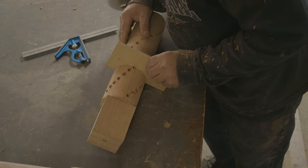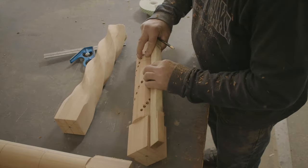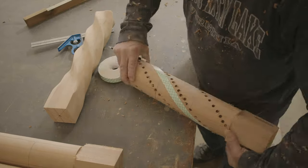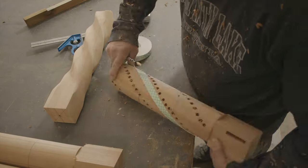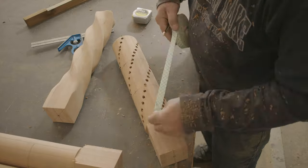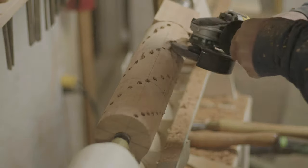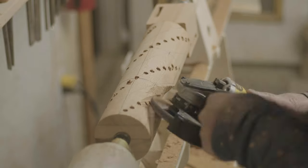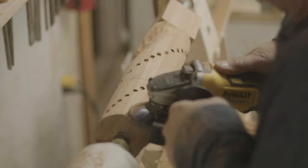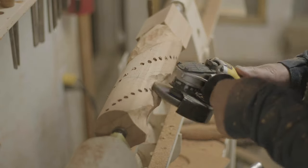The next step is to make my high point of the cove. The high point is coming off each corner, rounding down around. So I have a two-thirds twist. You can kind of see here I started right at the corner and come back — that is the high point. You don't want to touch that with a grinder. We've turned that on the cylinder, it's all going to be consistent, and that point stays the same. I couldn't grind on this on the lathe without having something holding the lathe from spinning on me. So I just went and grabbed an old ratchet strap, put it around the lathe and tightened it up. That way I could twist it by hand manually and just kind of grind away. This is just a typical grinder head you can buy at most woodworking stores — the grinder can be any four-inch grinder. I'm just going in there and barely taking out those little holes that were all a half inch deep off the drill press, and I'm forming my leg.